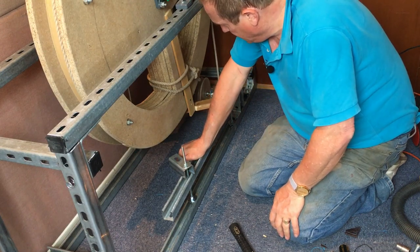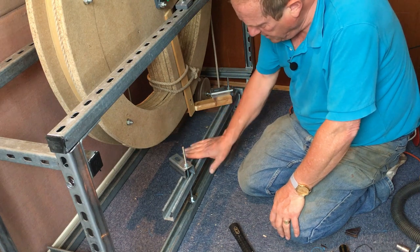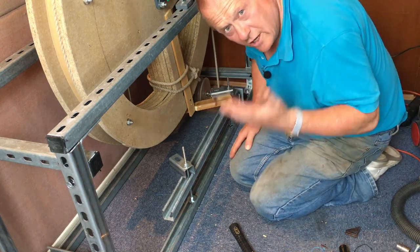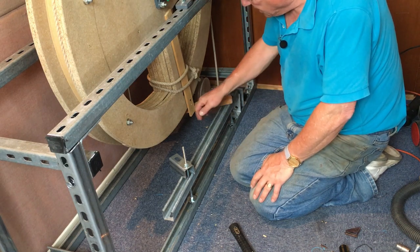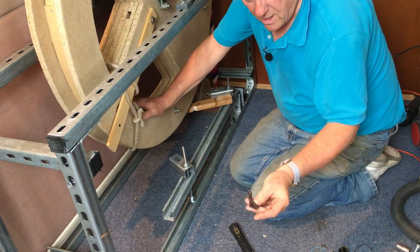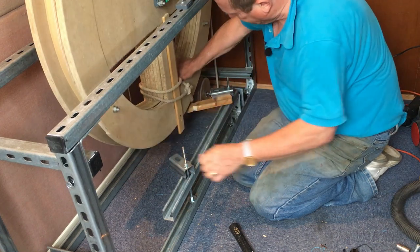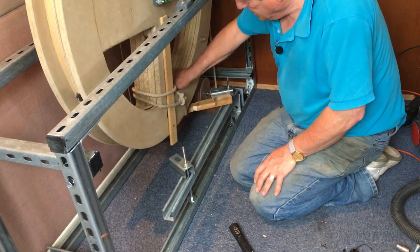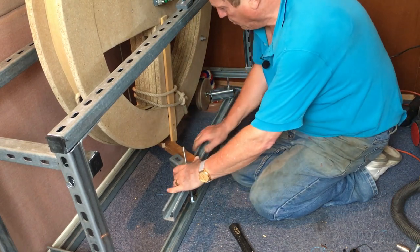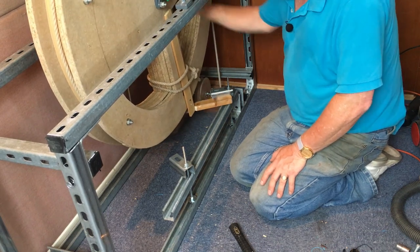Okay, so after an awful lot of fiddling, what I've done is I've created a stay rail, a slider rail, which I've mounted higher, and then I've used these stops to actually catch the slider when it gets to the end. So that's very similar to what you'd have in a normal belfry. I've put a notch into the slider so that it actually is reasonably straight when it hits, because the pin I'm using is actually a brown raw plug, or wall plug. So it has the ability to break, and I'm sure you have broken a few of them this afternoon. But that will allow it to act as a normal slider, does push it out a little bit. I can't quite work out why that is, but I can fiddle around and tinker with that. But the basic slider system is now operational.